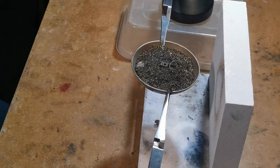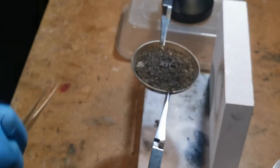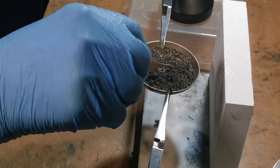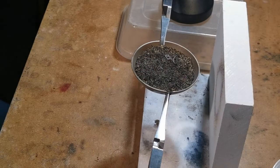I will heat it up to cherry red, or a bit hotter — almost to the orange — then quench it in the water I've got here. Having done that, I will temper it, which means I'll again use this bed of brass filings so that I can watch it change colour up to a reasonable colour, which should be a sort of azure blue, before it turns darker grey and then into red. I want to get it to that azure blue stage.